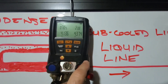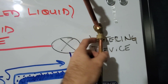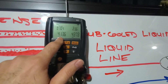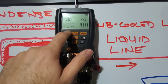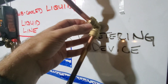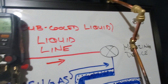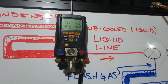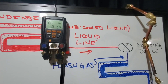These fittings are holding 413.6 PSI. They're rated for over 800 PSI — unfortunately I can't go that high with my reg, but they're clearly holding. Would I use these? Yes. They held over 400 PSI and were incredibly simple to install: clean the pipe, mark it, push it on, and you're good to go. They'd work great where you can't light a torch or you have a tight space. As for removal, we'll cover that in the next video since this one ran longer than expected. Happy HVACing!